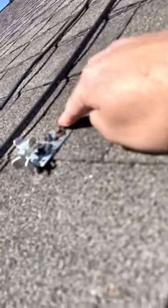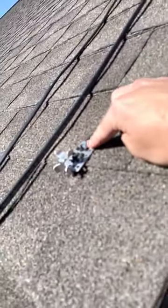Big red flag right here — clips are screwed in. The issue we're having is the breaker keeps tripping. Doing a rough estimate, I accounted for about 390 feet of cable on this side and 170 feet on that side. With a six-watt cable on a 120-volt circuit, you can get about 180 feet roughly per circuit.